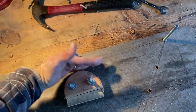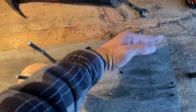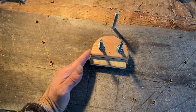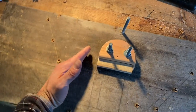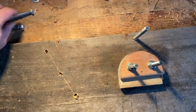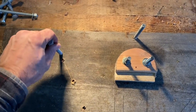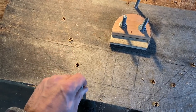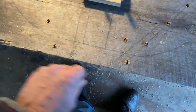The idea is to stick the bow in through here so that the end of it is up against this. After you steam it, slowly take a pipe or something to pull it down and form its shape. Then we can take a pin or a bolt — we'll use a bolt — and as we go along, we're just going to pin it so that it doesn't spring back until we get to our final hole. Then we'll tie it off.